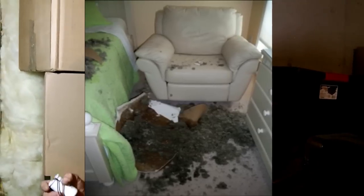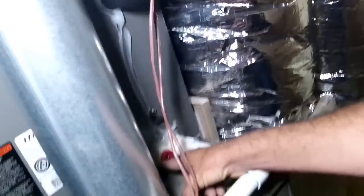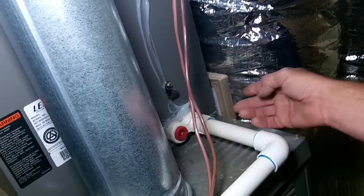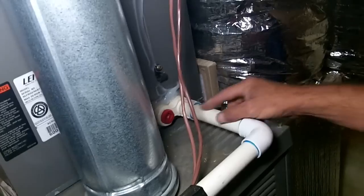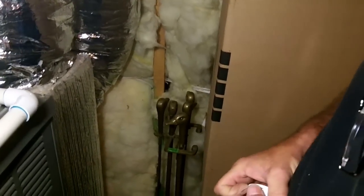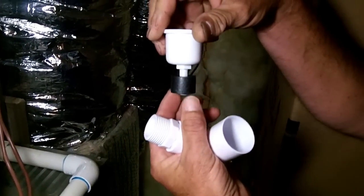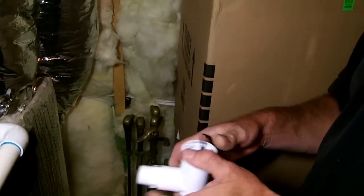What it does — if you'll come over here with the light — this little secondary opening right here with the red cap sits a little higher than the main drain. So if this main drain ever clogged up for any reason, water would come out of this one. And then what it would do — let me get this top off — it would fill this little 90 up and this little float switch would turn power off to the system. So you may never ever need it, but if you do need it, then you have it.